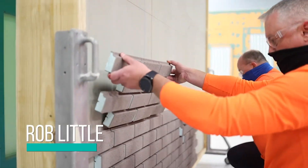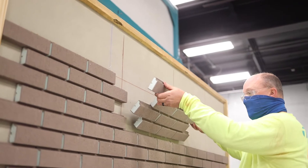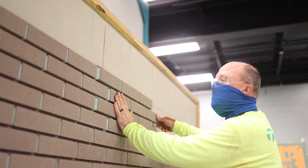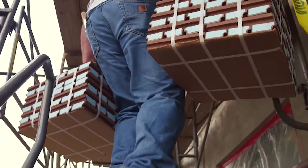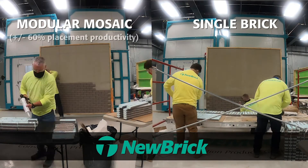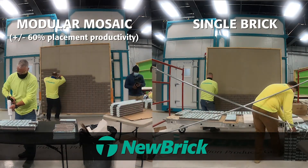It definitely goes up really quick — it kind of meets the expectations I had in that aspect. It was quite a bit faster; I would say it was probably twice as fast just off the top of my head. The mosaic product basically enables the contractor to increase productivity per man day versus traditional methods. With thin brick or traditional brick, that's basically 400 units or 200 square feet per man day, and with mosaic we perceive that it would double that productivity.